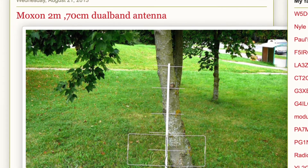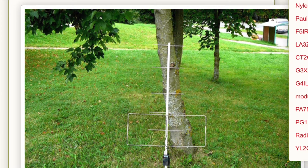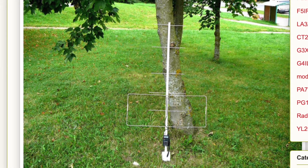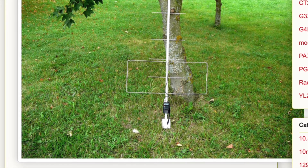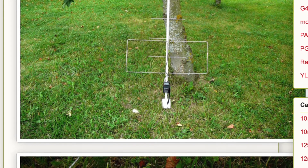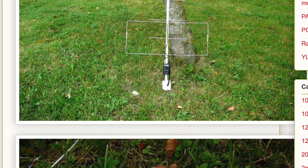As for how I built the antenna — I got the idea from another site where someone had built a Moxon 2-meter 70-centimeter satellite antenna as well. But I didn't use his exact specs because the materials I had on hand were different. He used eighth-inch, very thin aluminum or steel. I had quarter-inch, so the elements are larger. That changes the variables in the calculations.